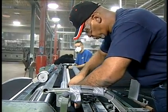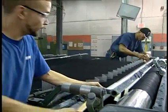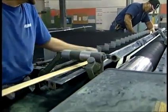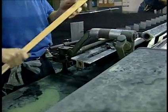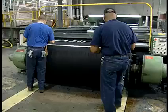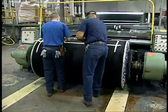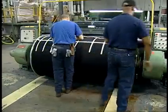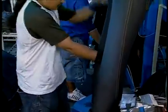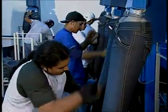After passing through the split rods, the warp yarns are collected into one single sheet and pass through a comb which helps to separate individual yarns originating from a particular section beam. An expansion comb is used to adjust the width of the sheet of yarns to the loom beam width and to evenly space the yarns. At this point all the warp yarns are wound onto a single loom beam. Normally several loom beams are produced from a single set of section beams. In many denim styles, the size will be left on the fabric and act as a stiffening agent that aids in garment manufacturing.